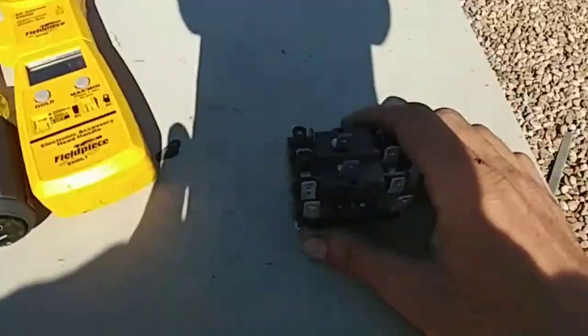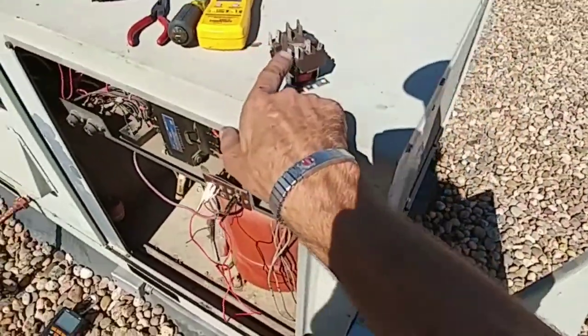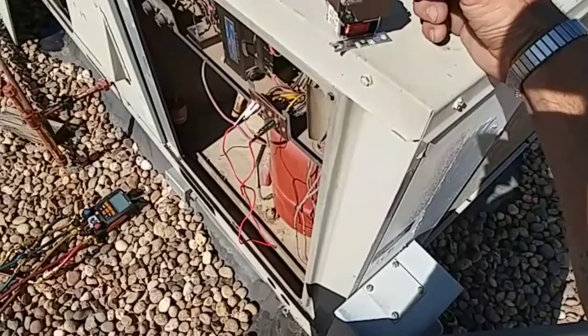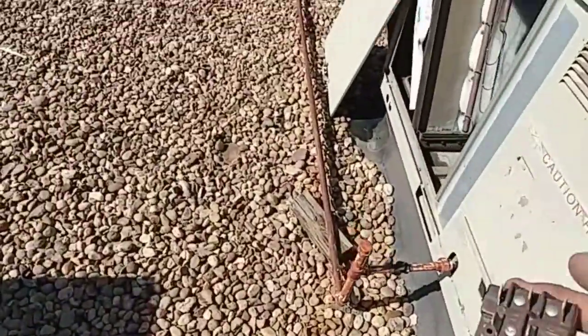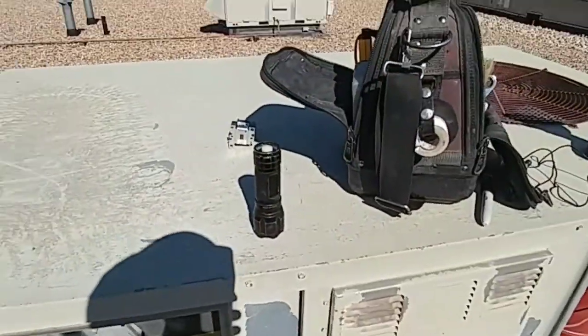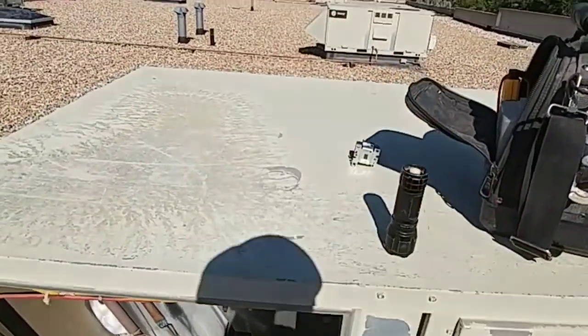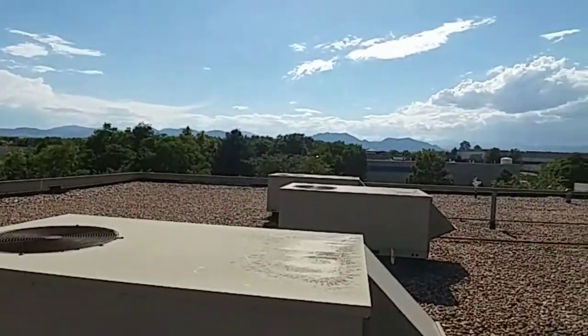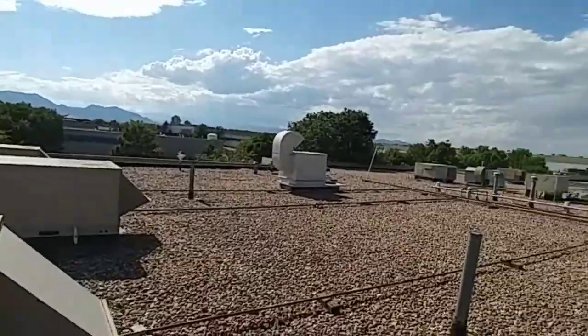That's how you check it one more time: 24 volts here, you read nothing here. If you read voltage here, then the contacts are shot. You can also ohm it out — take your meter, go across these two when voltage is applied. But that's garbage. Like, subscribe, and rock on — you guys have an awesome day.